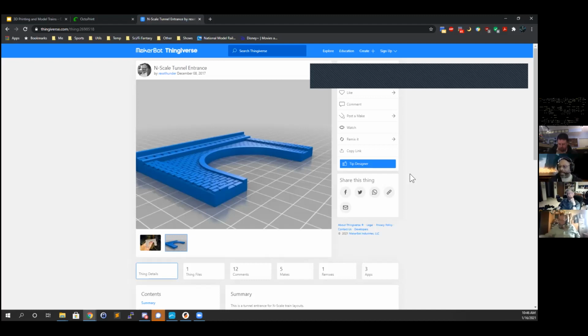There's no way to detect it. The one I use the most now, that you just saw, has crash detection on it. So if it bumps into something and detects that it's crashed, it'll actually raise the head up a little bit so it doesn't hit anything, re-zero the head to recalibrate, and then go right back to where it was and continue to print, and you'll never see any issues with it. Those are some of the features that I was looking for. Like I said, the bed warping: a metal print bed is hardly ever completely flat. And if it warps just a little bit, you can get where it's a little high here, a little low there.